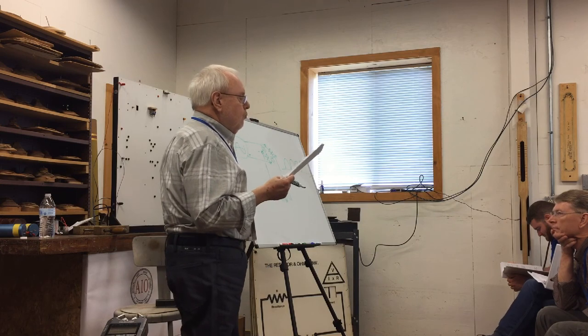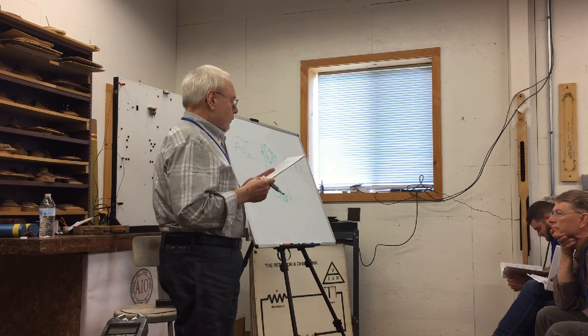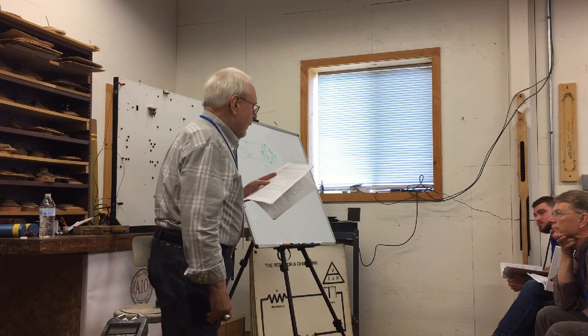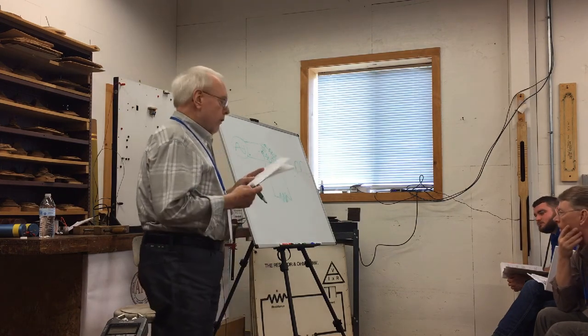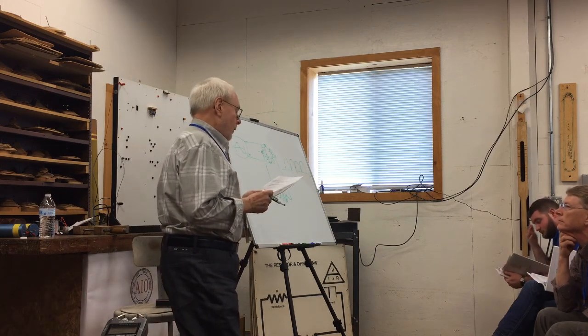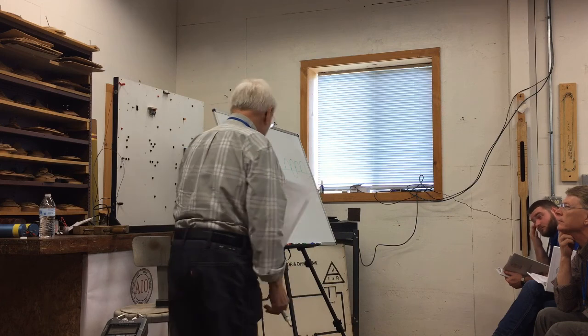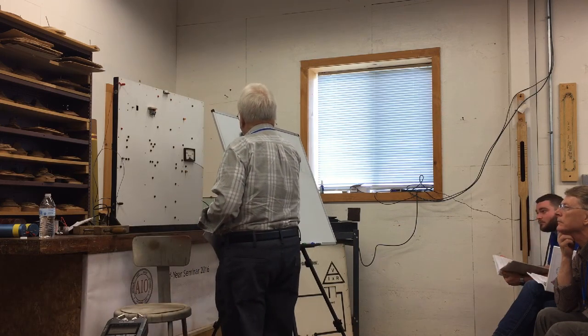In the organ, we usually don't hook up alternators to the blower motor. There's loads of alternating current coming in from the electric pole, but it's hot, 120 or 240 volts at least. It would certainly toast our poor magnets, so we transform it with a transformer, which looks like this.